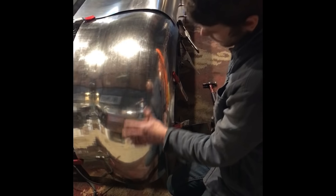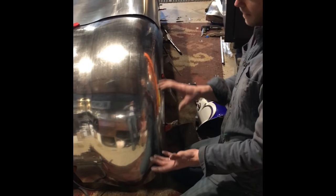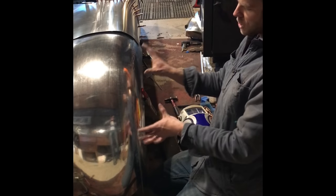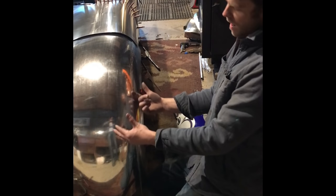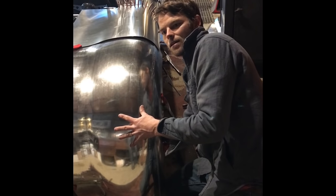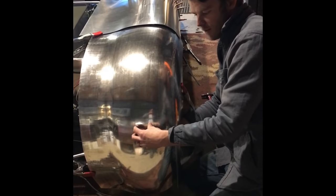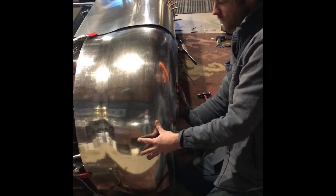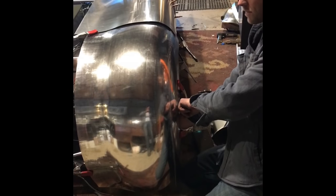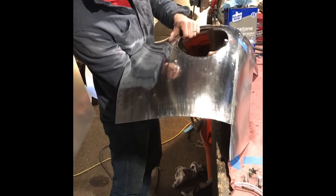And a couple of things when you go to cut the headlight bucket in, and different people do this different ways. I fix my headlight buckets to the tubular buck. I shape my panel, and then I will remove the headlight bucket because it's touching inside here almost 360 degrees. It's touching the panel, so it's a really nice close fit already. I'll cut the headlight bucket out of the tube buck, and then I'll weld it in to the fender here.